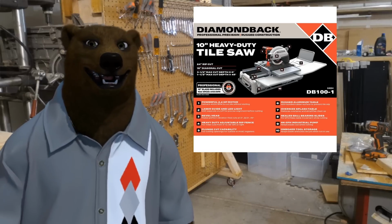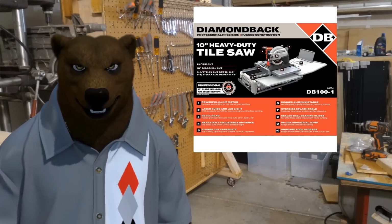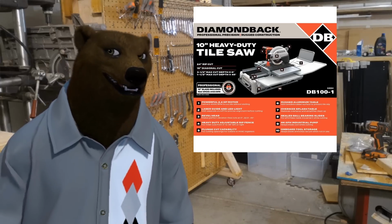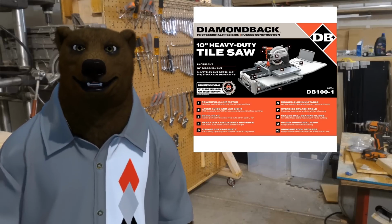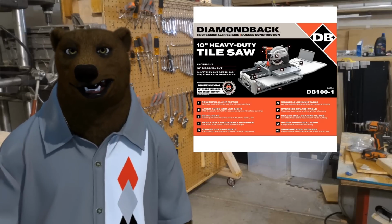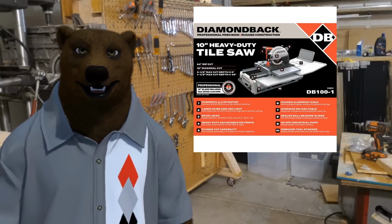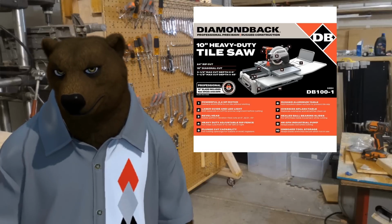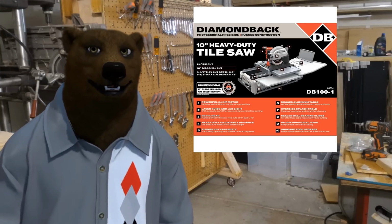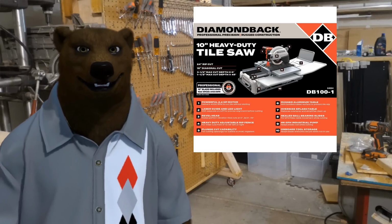Having said that, I've only really got a lot of experience with the benchtop tile saws, the much smaller ones. And after using those, moving up to something like this, this thing was a dream to work with. It's got 24-inch rip cut capacity, 18-inch diagonal cut, 3.5-inch max cut depth, and 1.5-inch max cut depth at a 45-degree bevel. It does come with that 10-inch blade. Boy, I gotta say, putting that blade on was so easy. I wish more miter saws and chop saws were that easy to work on.